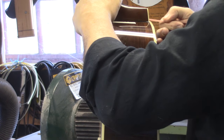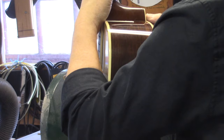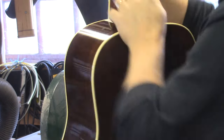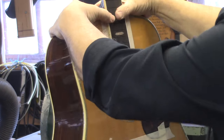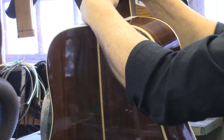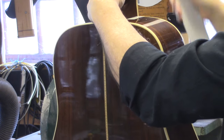One stroke on each side to make sure you keep this whole thing aligned side to side. Turning it around to check it again on the face, making sure that we haven't gone off. Well, that's looking pretty good. I'm checking that angle with my pilot frets. Yeah, I'm very happy with that.